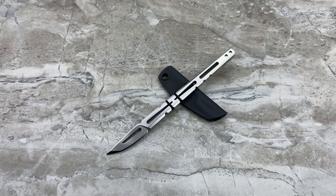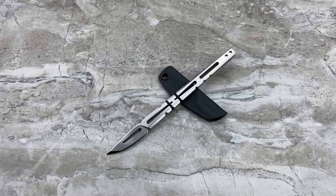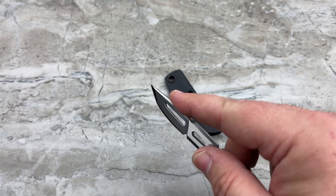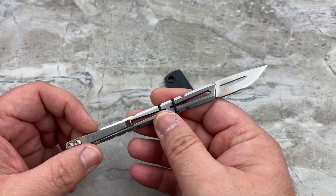This entire knife is CPM S35VN steel. I'm certain he has and will continue to use different steels, but this one is S35VN, as are his current offerings at the time of recording. It's 5/32nds of an inch thick. The blade edge is 1 and 5/8 inches — yeah, that's not a lot, but this is not a giant fixed blade. It's going to be great for cutting paracord, slicing into a USPS priority box, or cutting a little piece of cardboard. He does heat treat through Boz Heat Treat, which is super phenomenal — Boz and Peters really are the leaders in heat treating.